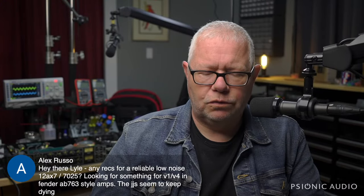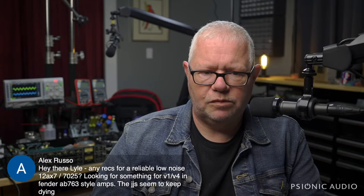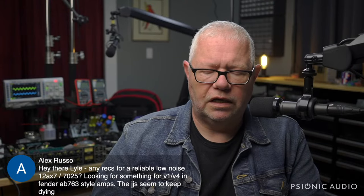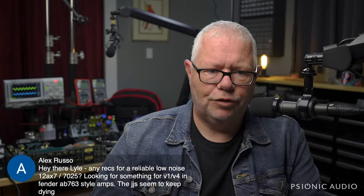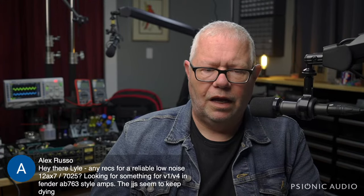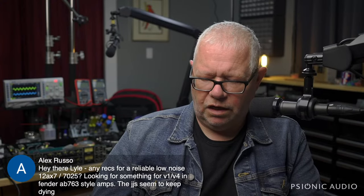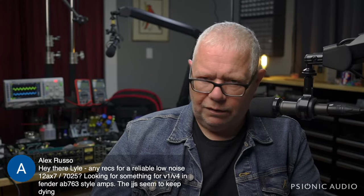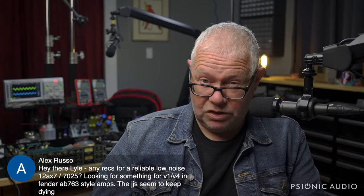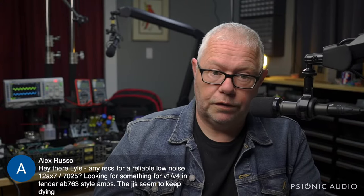The one I like the most right now is not always available. It's the TAD Red Bass Premium 7025. Those have been fantastic when I can get them, but the vendors seem to be out of them right now. I've also had very good luck recently with Electro-Harmonix 7025. I do not like the Electro-Harmonix 12AX7. That's the one with the yellow print, but the 7025 with the silver print, I've had very good luck with.